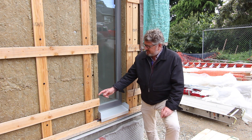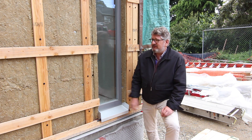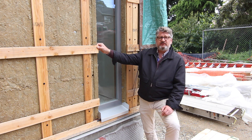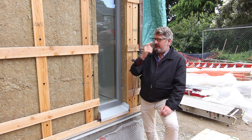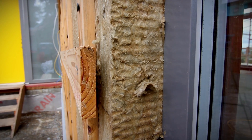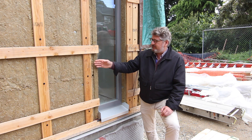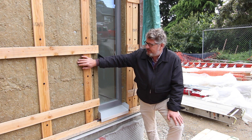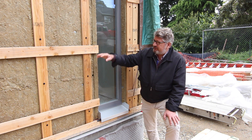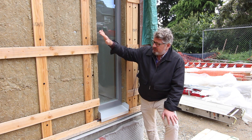This is something we've emphasized a lot as we've gotten into high performance building: this ventilated siding system, often referred to as rain screen. The real important point is that getting air to move behind the siding increases the drying capacity of the whole wall assembly, because we're relying on this to do bulk water management. This is a hydrophobic surface — the mineral wool just beads and runs off — so any water that gets behind the siding will wet it a little but most of it will run off.